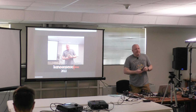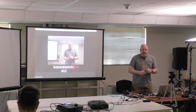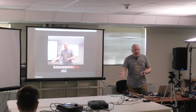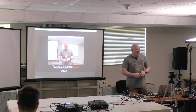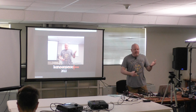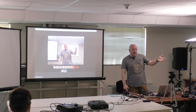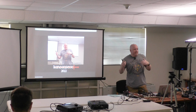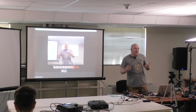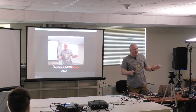It's similar in concept to a Reloaded board, but I have no intention to productize this. In order to build this board, you have to take chips out of a 2GS. There's no other source for the Mega 2 or the slot maker. You could get away with not having the IWM, but from a practical perspective, I don't think this makes much sense unless you have a 2GS with a battery-bombed board. Otherwise, why would you put this into something else? That doesn't preclude an idea for a follow-on project where we could do something like that, but I don't intend for that to be this case. My goal was to do this project to see if the Mega 2 would work and leave it at that. My hope was that other people wouldn't have to destroy computers to find out what I found out. So far, if I put the chips back, my 2GSs still work.